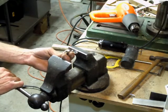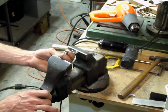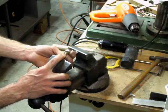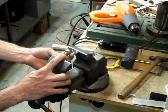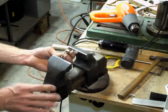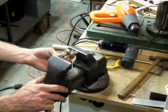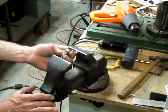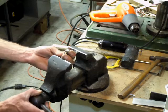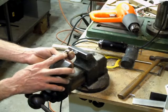You're probably going to break some magnets, but it's kind of a difficult thing. Another side note: some of these magnets aren't glued on very well at all, and you can just stick them in the vise without heating anything up and just give them a tap with the wood and they pop right out. So always try that first — start with the simple and work towards the more complicated. Always hit it with a piece of wood.